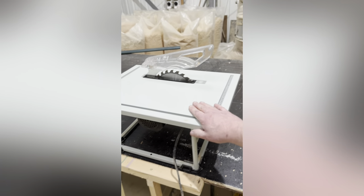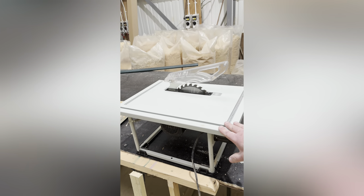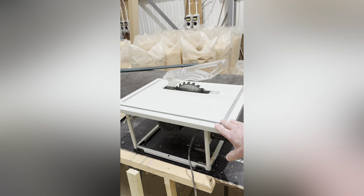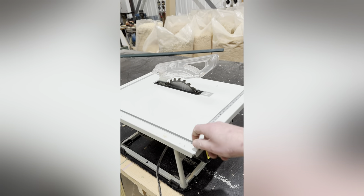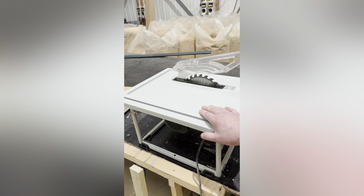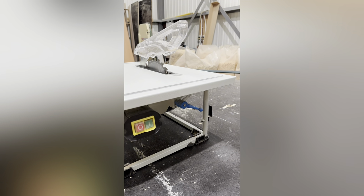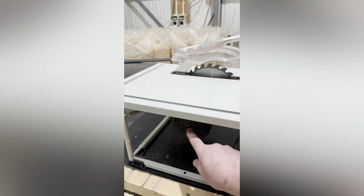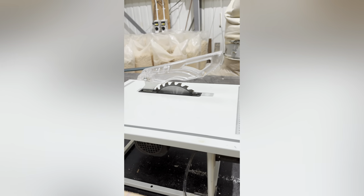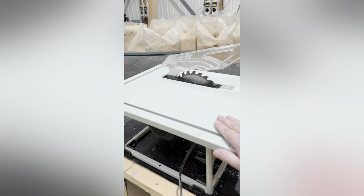Now I've got this little table saw here just to show you — it's basically the same machine on a small scale. This is the type of table saw you'd buy from a tool shop. It has a tin pressed steel bed. It's still got the tilt action and the rise and fall underneath, but it's a lot simpler. It has a start/stop with a built-in brake in the motor, unlike the separate box on the big machines. It's single-phase so it just runs on a normal 13-amp plug.